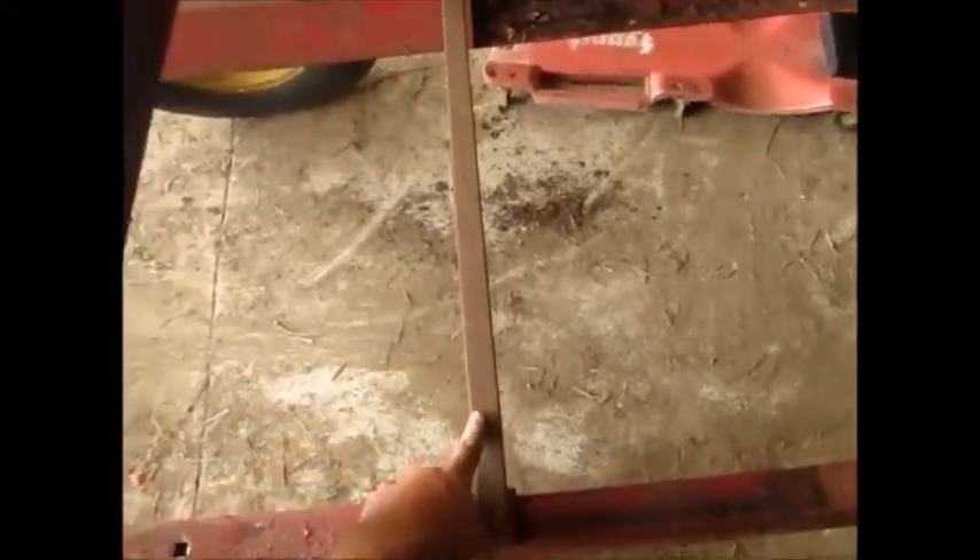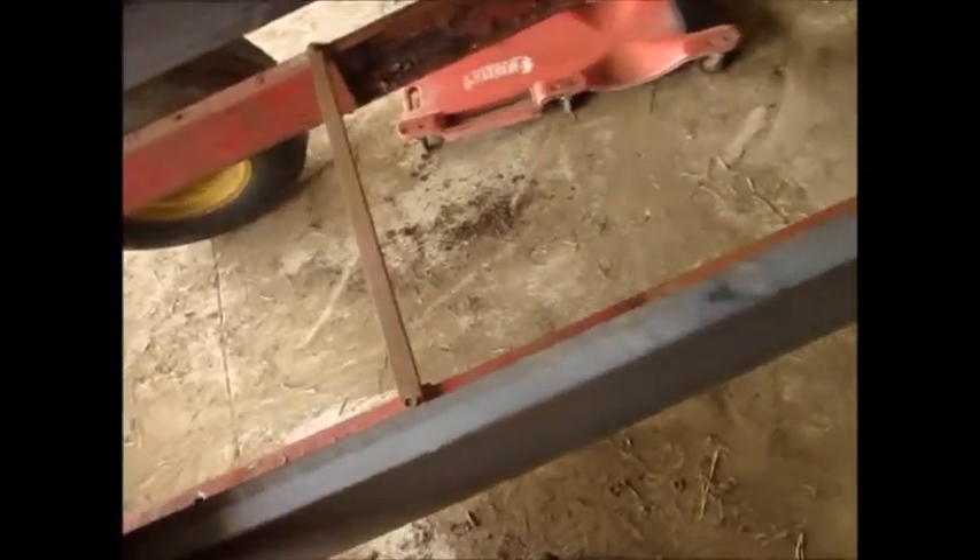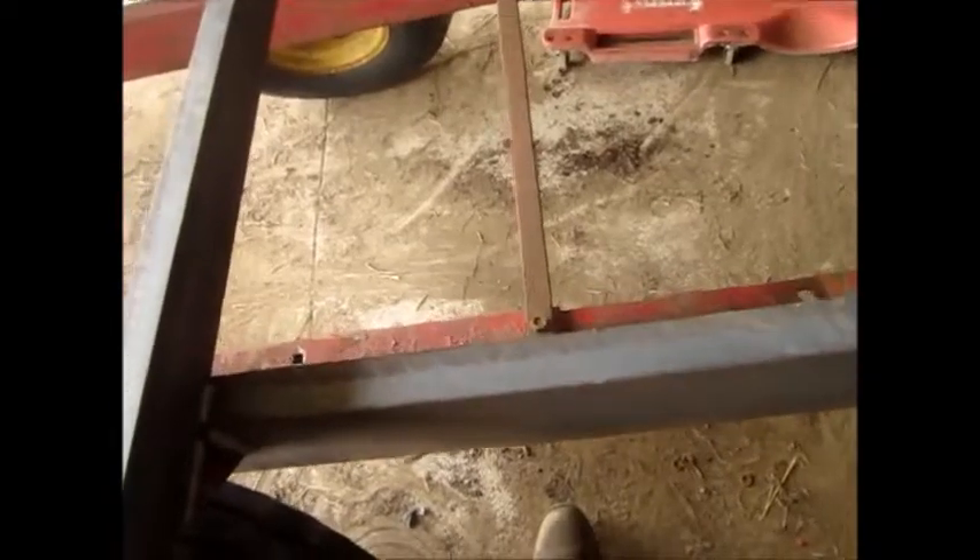I don't know how this will affect anything, but I added this piece in here just now. Because these two thin pieces of C-channel were double bolted — you see where they overlapped — so I wanted to lengthen the frame out. I'm going to try this, see if it holds up and holds everything together. I figured I'd add this piece in here to stiffen those two up. It ain't going to hold any weight — it just has to hold the front tires to the back tires.